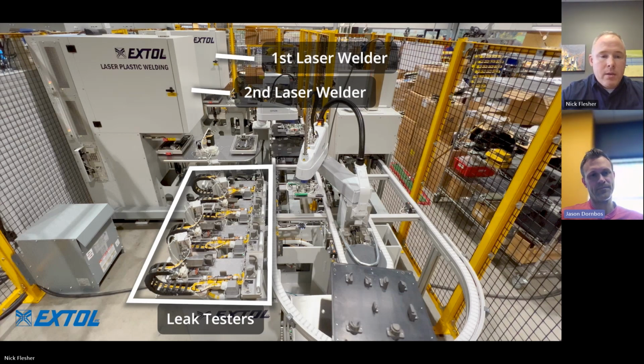Yeah. So again, we typically do that as plastics joining people, not specific to laser welding people, but there's pros and cons to every single technology that we use. And laser welding, super fast, super clean. But some of the cons are you got to make sure you've got good transmissivity in those parts, and making sure your parts aren't terribly dirty is a part of that process.